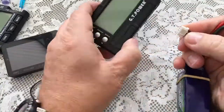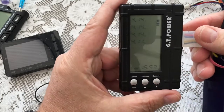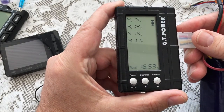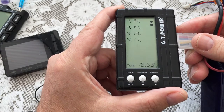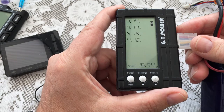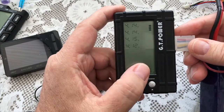Then you have one of these. Plug it into the 4S slot. And as you can see, the battery is charged — been charged for a week. And one of the cells has drifted. So immediately I know that I may have an issue with that last cell.